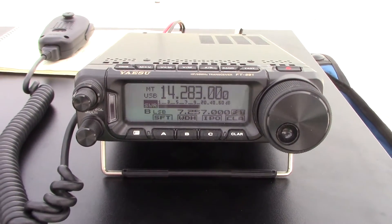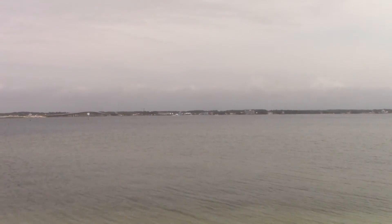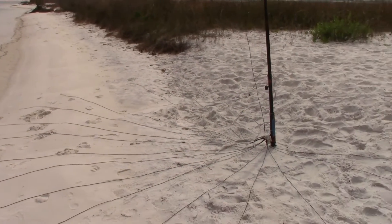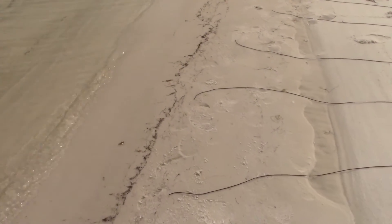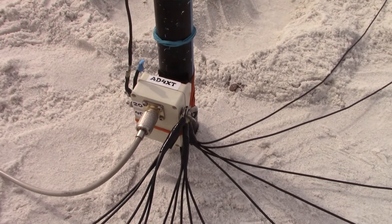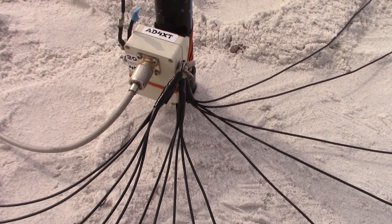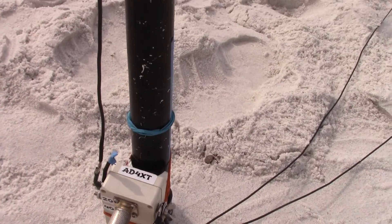Looks like a big signal already out of Texas. The big thing is the antenna setup. We're at the beach and this is the bay water — that is mainland you're looking at there. The ocean is directly behind me. I've got my seventeen and a half foot vertical wire with sixteen radials on the ground, all the way to the edge of the salt water. I've got them all pointed towards the north — that's the whole idea. It's just a center connector and a seventeen and a half foot wire — a quarter wave vertical on my Chinese fishing pole.